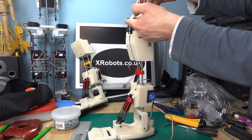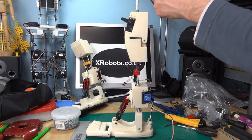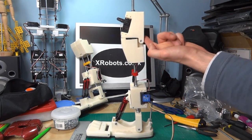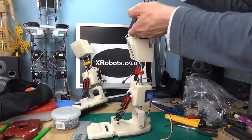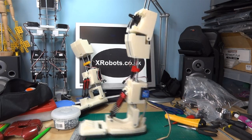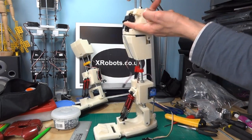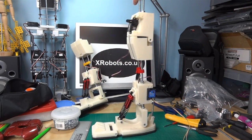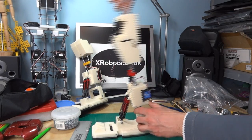When the servo pulls tight the knee is quite stable, and with the axis off-centre and the weight coming down this path it doesn't bend until you actually break the back of the knee — which is basically the same as a human. The plan is to have a gyro fitted the same as with the ankle, so as the leg kicks forward the knee can bend and the servo releases, and then as it pushes back this tightens and the leg straightens, with the load taken on the ankle.